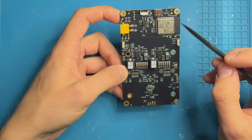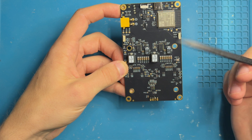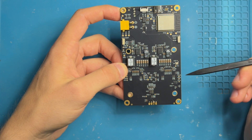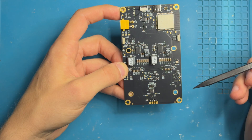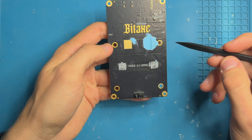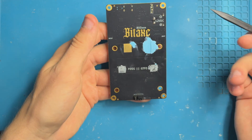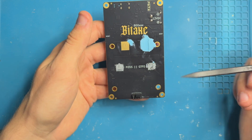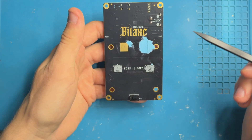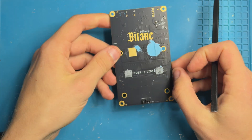Apart from that, all the other components are basically the same. There's a small TPS regulator for the ESP32. This is a dual-chip device — our first approach of playing with 12 volts, experimenting with temperature reading, and trying to use two chips simultaneously. It was initially a little finicky but we figured it out quickly. This testing device is currently the latest standard on the repository, which is already open source, so you can build one yourself. However, it is not yet released for mass production, as we needed to fix a couple of minor bugs that we have now done.